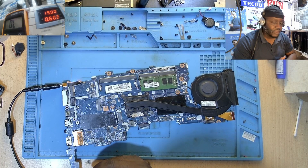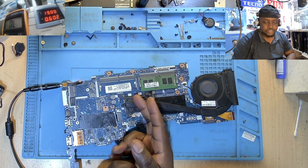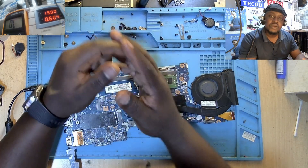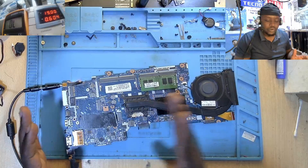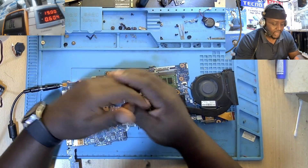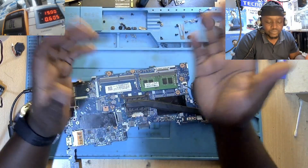The video I made recently was about the same HP 840 G3 model — that one had a freezing screen. But what I want to put across here is: it's not always the case that when a machine has all its voltages and the fan spinning, you should go straight and blame the BIOS. Some are voltage issues, some are chip issues, and some are hardware issues on the motherboard.